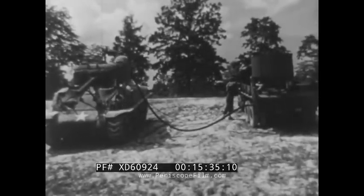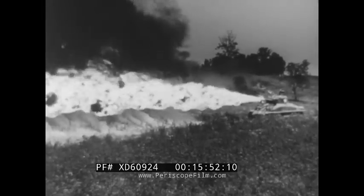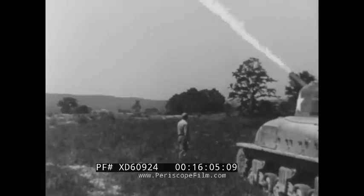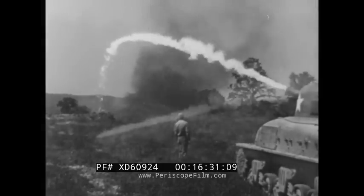As a final precaution, fire a flushing load of light oil. Fill the main fuel containers and let the oil stand in them for 24 hours — firing this will clean out the entire flamethrower system. When tactical and supply conditions permit, test your fire with thickened fuel. Have observers check ignition, the stability of the rod — that is, how it stays together — and also the range. Make sure your weapon is right. It's not enough just to get it in action; you've got to get it there in perfect shape. Then it will do what it was made to do.